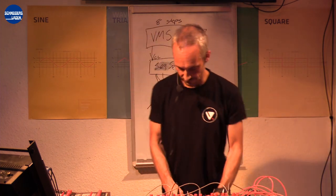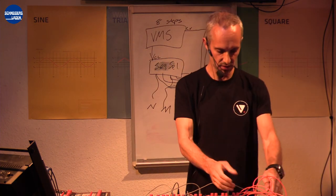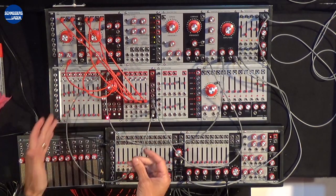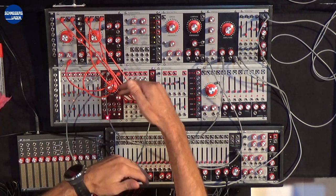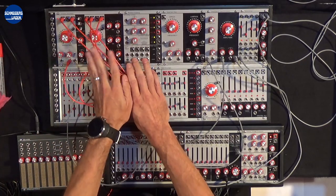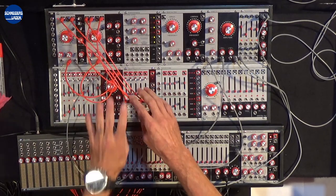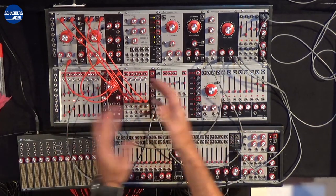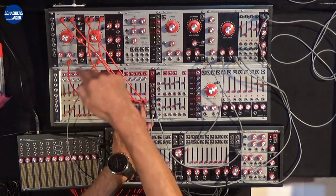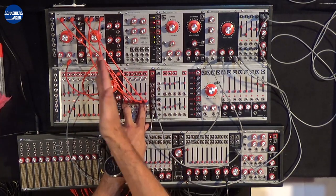So the final thing that I wanted to include was actually to do some stuff with the sequence selector working against the voltage multistage. I mean, this is already doing that, but so far it's just doing the wave selection using these selectors, which I'll go into a little bit more first, but then I'm going to talk about ways of using these selectors to select among triggers and select among feedback points or resets or whatever.